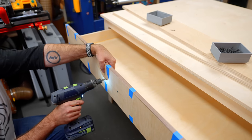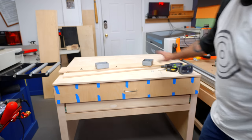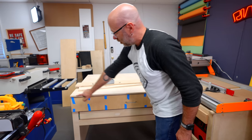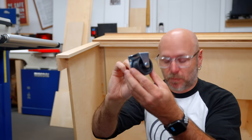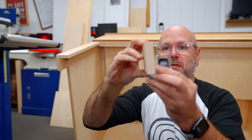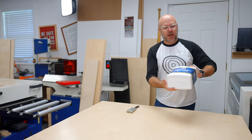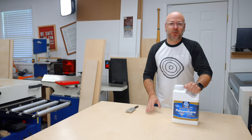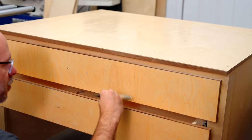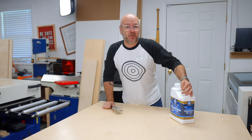So now I can remove these front screws. I've made the face bigger than you'd normally would, just to cover up the opening — this is a new look I'm going for in the shop. We do the same thing with the other drawer, and then we're going to add a piece of edge banding along the top. Typically I don't put casters on my shop furniture, but I've got a feeling I'm going to need to roll this one out every once in a while. These are low-profile casters that screw onto the bottom of the plywood. For the finish, I'm using a water-based polyurethane made for floors — it doesn't yellow, and when you put an oil finish on Baltic birch plywood it yellows like crazy. It dries really fast, only about an hour. I'm pretty happy with the results.